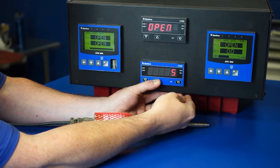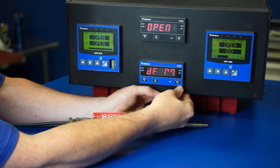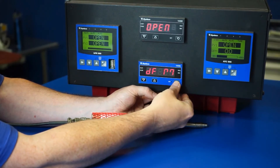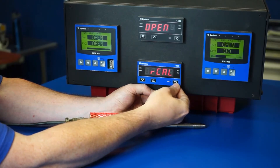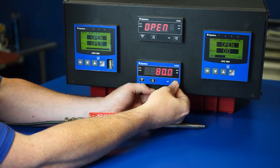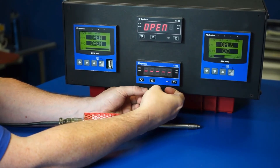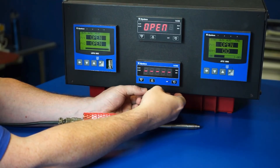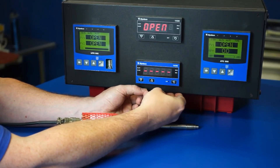U-lock appears and then the up arrow key is pressed until the number 10 is reached. The technician then presses the set key again to access the calibration function. After confirmation of the shunt value of 80%, the instrument prompts the technician to test the high and low calibration points via the up and down arrow keys as demonstrated. Once the high and low points have been tested, the indication device will display DONE, then the calibration is complete.